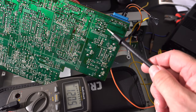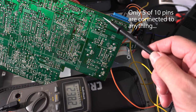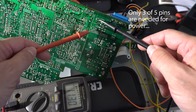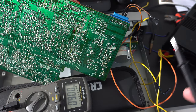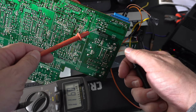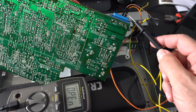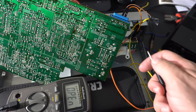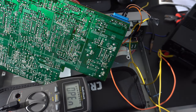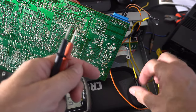These two wires went to the little rectifier diode and everything's really neatly labeled over here. I'm able to look at the other side of those diodes and say minus and plus, and I get my 12 volts DC - well, 11.3 volts, close enough. If I went to my ground and 12 volts I'm only getting 0.9 volts. In addition to the two pins going to the rectifier diodes, there's another pin that I don't have anything hooked up to that is connected directly to ground. I took my minus, sent that to ground, and the thing lit up.